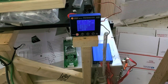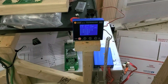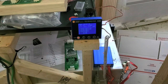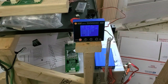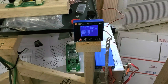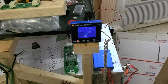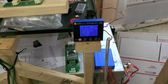or over-voltage, anything else like that. My inverter is going to be my under-voltage protection. Thanks to the Wi-Fi board, I can set the exact voltage and calibrate it to make sure it's accurate. I can set when the batteries will be at their lowest. The inverter will then shut down when it reaches a certain voltage — that is my under-voltage protection. My over-voltage protection is going to be the charge controllers themselves. I'll set them where I'm comfortable, and then they will run at float. The BMS — the only job it has, strictly, is balancing the cells.